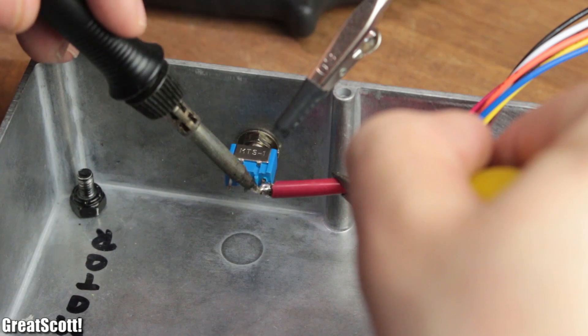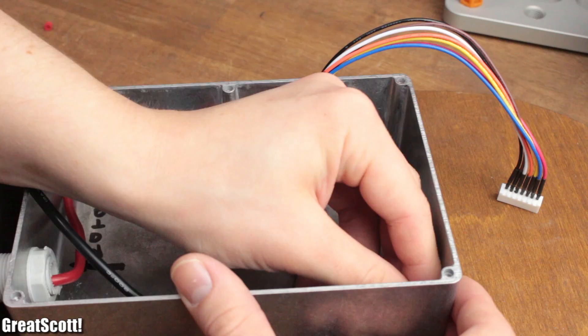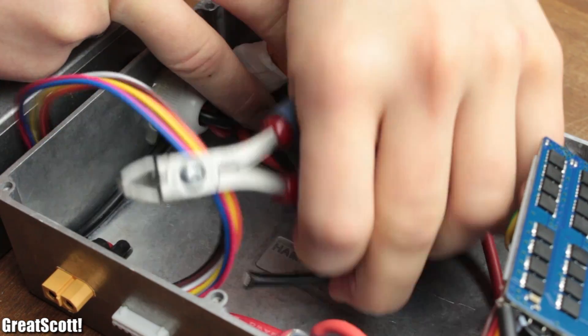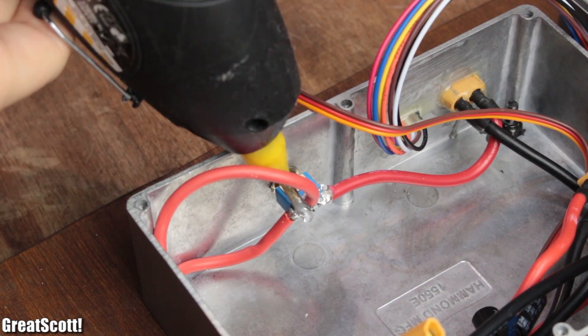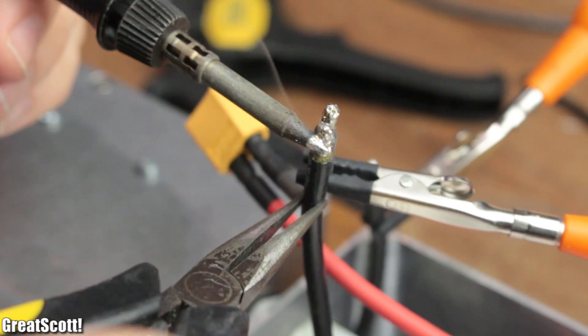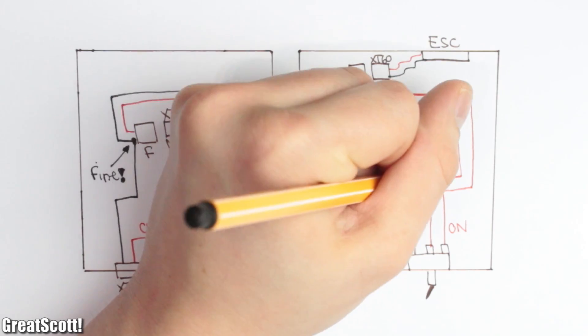In real life there were some small things I'd like to mention. You should always keep your wire length short and the layout clear and simple to avoid a mess, because wires can eat up a lot of space. Hot glue can be used to isolate the switch terminals from each other, and while soldering two wires at one terminal of an XT60 connector does work fine, three at the same time is not recommended — I'll create a separate tie point instead.